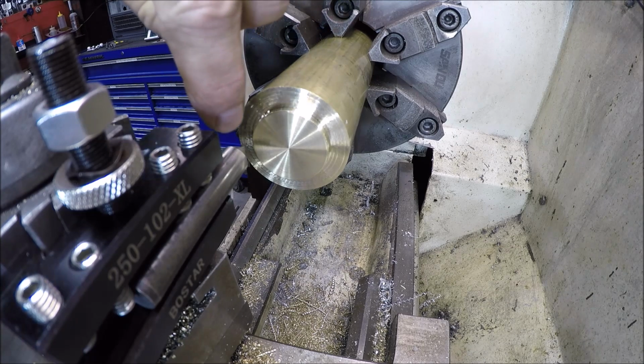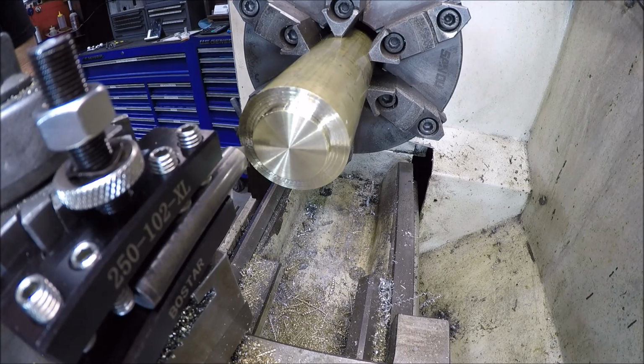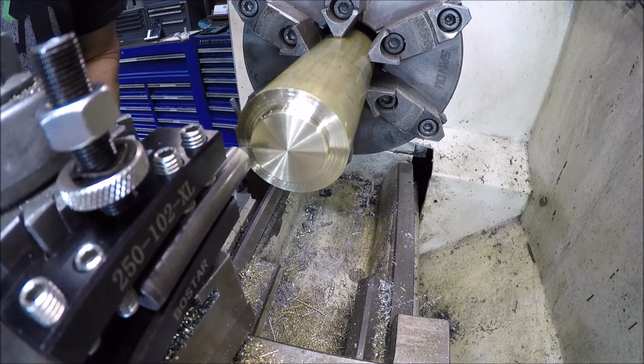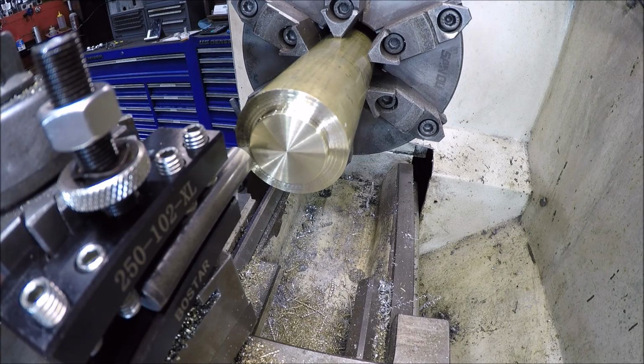So what I want to do, I want to etch a line across, and then we'll rotate her 90 degrees and we'll do another one. So we have a nice cross or an X, depending on how you're looking at it. Just have a sharp, basically a dead center. So I'm going to go in and we're going to try to go all the way across and see if this works. Alright, that's 7 thou. We may be getting greedy. Let's back her off. We can always go deeper. There's 4.7. Let's see how she's going to do.